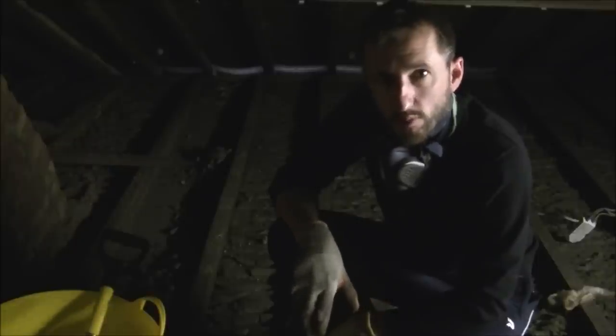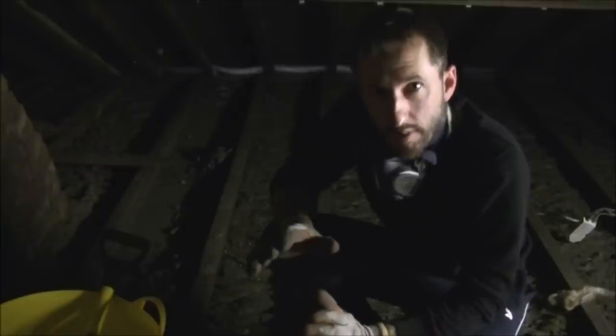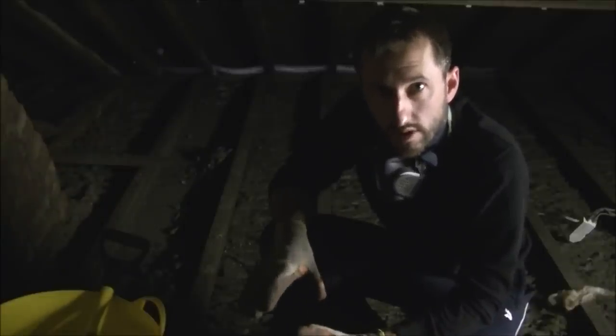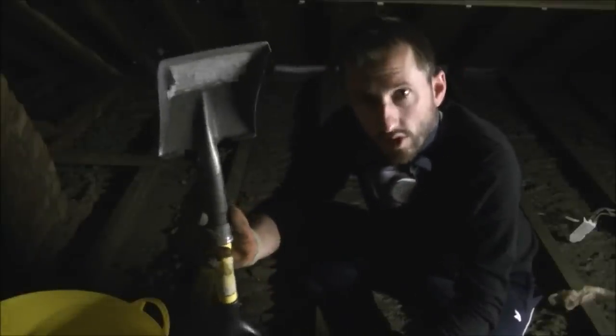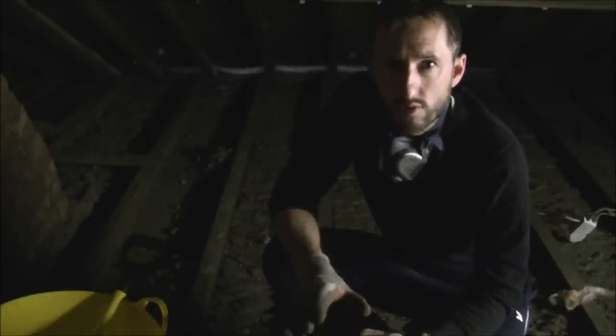The task today is trying to remove the old lime mortar. When I renovated the house I underboarded with plasterboard, so on top we've still got the wooden lath and the lime mortar. Unfortunately where the old mortar is pushed up through the lath it's sticking proud, and if you were to get the new joists and just pop them on top and bang them into place you can knock the old plasterboard down and potentially crack the whole ceiling. So this may seem long-winded but it's essential. I'm just going to use this little shovel, work my way across the floor, scrape it up, put it in a bucket, and get it as flat as possible.